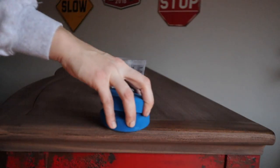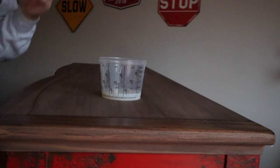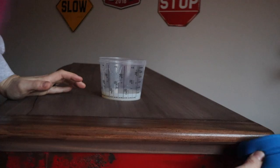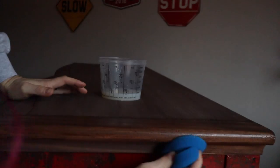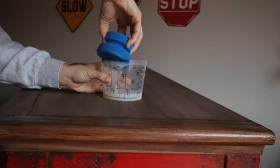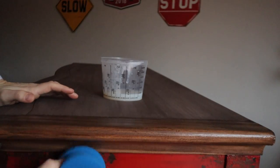So if you have a tack cloth, make sure you're looking at it. The ones that I'm going to link below do not have silicone in them, but make sure that you pay attention, because if it does have silicone in it, it's not something that you should be using with a water-based top coat. Now, I am using an applicator sponge, which many different companies carry. And what I'm doing is thin coats, going with the grain.